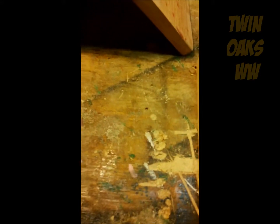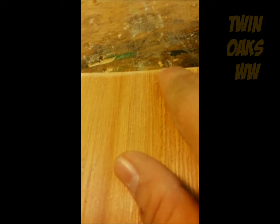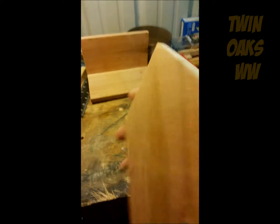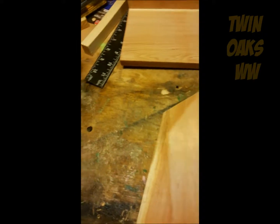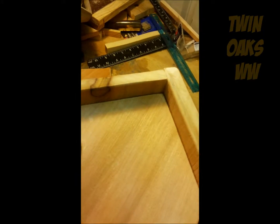This here is going to be our back piece. This is going to be the outside of the back, so we're going to flip it over — that's going to be our inside. I'll just take a pencil and write a B for back so we don't get confused. Sometimes I'll also write a B down here so I know that's the bottom. We're going to measure halfway — if it's five and a half, that would be 2.75. After you cut your pieces, this is the front inside and this is the back inside. We went ahead and cut them out, touched them up on the sander, and dry-fitted them to make sure everything would fit. As you can see, everything fits just good — real good, almost perfect.